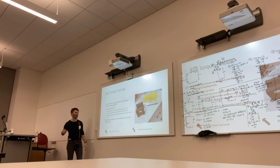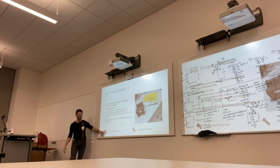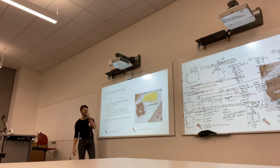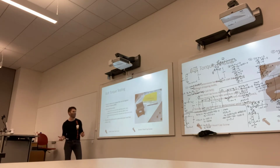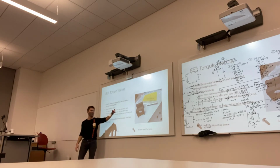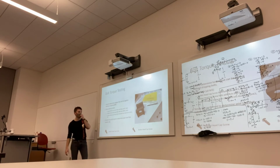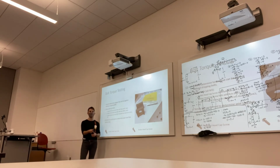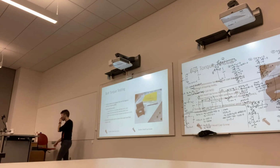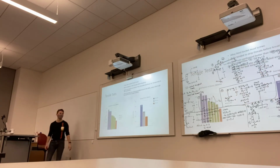So we checked a few different things. We checked different bolt configurations. We checked socket heads, which are basically the standard ones. They have these nice little extruded heads that are pretty easy to interface. Button head cap screws were the other one we checked. We needed some more low profile bolts to work with, so we wanted to see if those slipped at earlier forces. And then we took these 2 bolts and threaded them into 3 different things. 2 of them were nuts, because that was a common way of mounting them. And one was a piece of aluminum that we had water jet out and then threaded into, to see, given that we have a lot of aluminum threaded connections, if that is going to fail at an earlier point. So here's some of the results from that, just to briefly talk about.